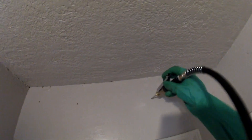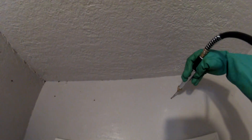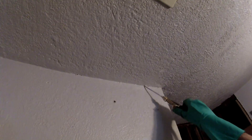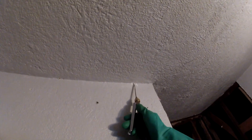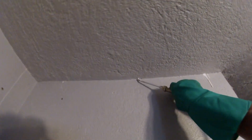I'm moving it back and forth, expanding it right and left to make certain it's covered on both sides of the 2x4 and top. I'm applying the foam on top of the 2x4 inside the attic and moving it right and left to get as much coverage as possible. You could possibly cover it better from inside if you have attic access, but my attic is really low so I don't have a lot of options.